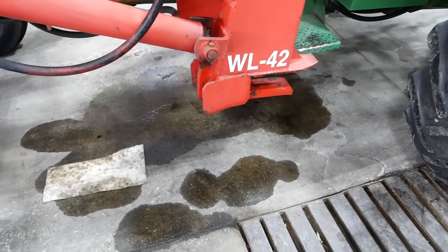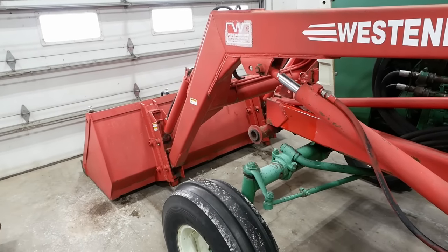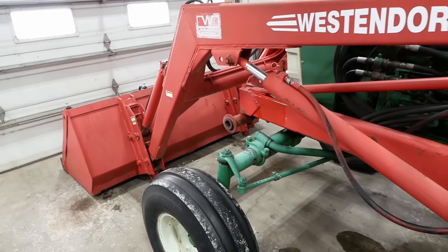It's an old tractor, it's got a ton of hours on it, it leaks every fluid from every orifice, it doesn't like to start when it's cold, doesn't like to stay running when it's cold. The loader is probably too big for it, and the power steering isn't strong enough. But there's a couple of unique Oliver design features that make them poorly suited for use with a loader, at least in my opinion. The first one is the clutch.